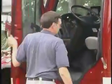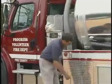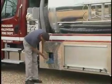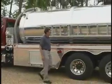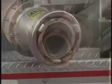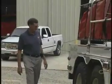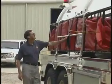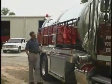The WaterMaster is a baffled aluminum tank with a 3,500 gallon capacity. Many models are available and all come standard with a 430 cubic foot per minute vacuum pump and 6-inch hoses. The WaterMaster is capable of filling from 1, 2, or 3 suction lines and lifts water up to 28 feet. Additionally, the WaterMaster maintains dependable filling because the pump does not have to be primed, and air leaks will not shut down the filling process.